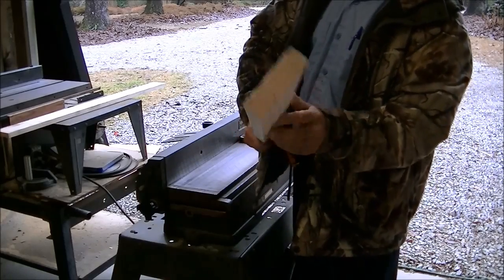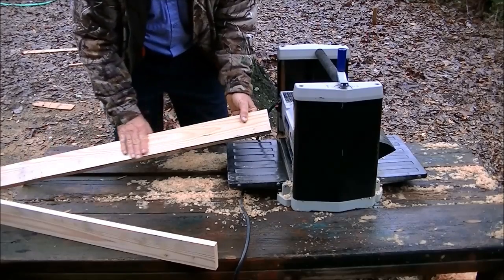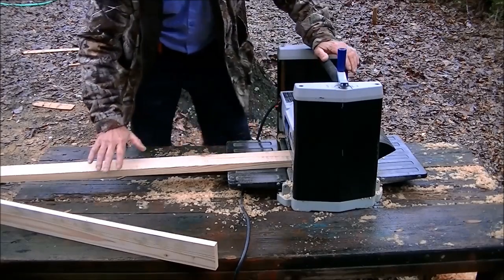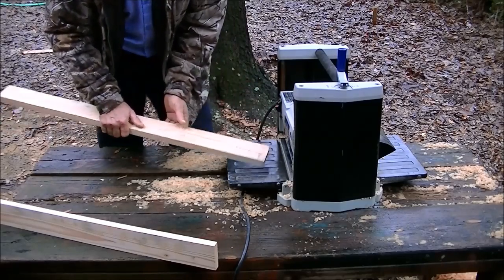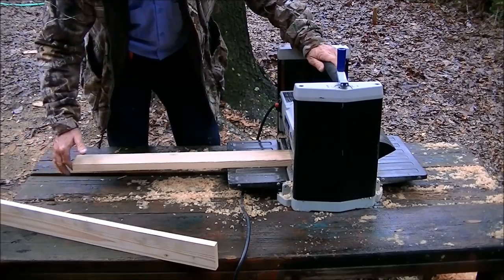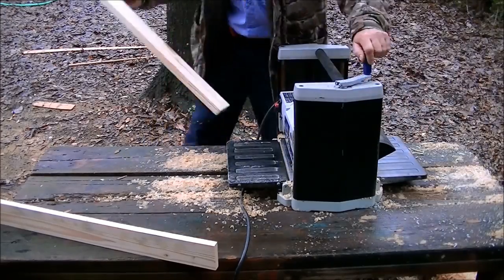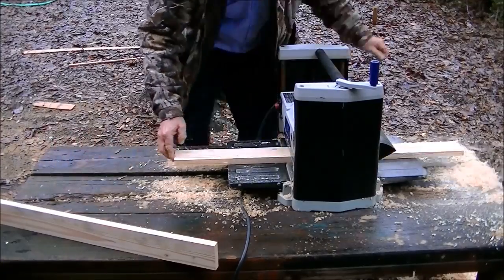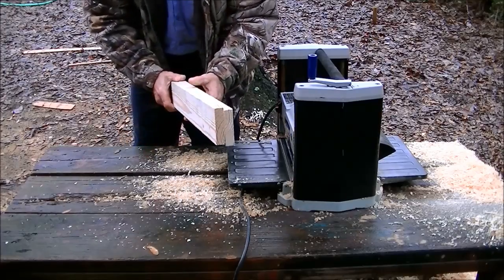Let's head over there. It's adjustable up and down by the handle, it's got a gauge on the side and it rides the perfectly smooth flat side face down. There's a blade with wheel and rollers that pull it through, that hit the top side and makes it perfectly parallel to the smooth side. You have to do several passes — I'm going to get this down to three quarters of an inch thick, so it's going to take a few passes. I like to do it outside because it's so messy. Right now we have the same thickness.